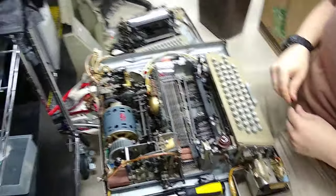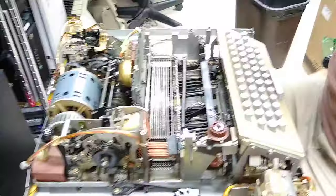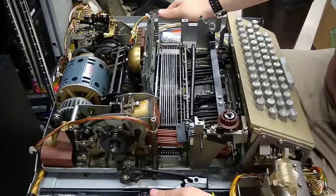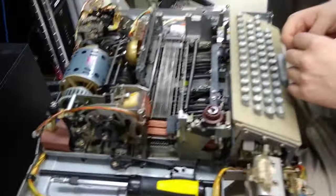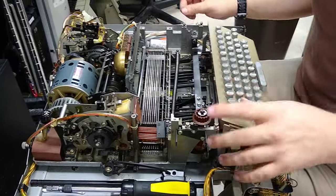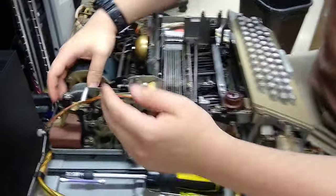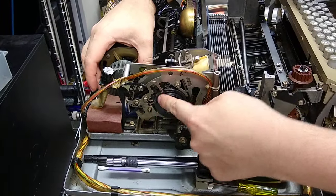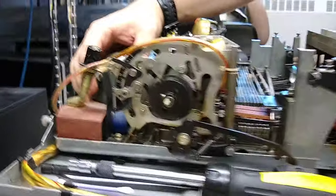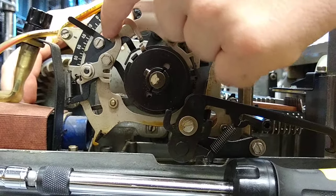Since we sent a bell earlier, let's actually set up a bell character. With the platen and carriage removed, we can't really show typing a regular character, but the bell — literally the bell — is actually attached and we can receive that. The device here is called the rangefinder, and what it does is synchronize this machine with the remote one. When this arm comes up, that's the beginning of the receiving of a serial string. If an alignment needed to be done, this arm would stick down and help align things.